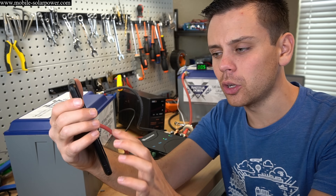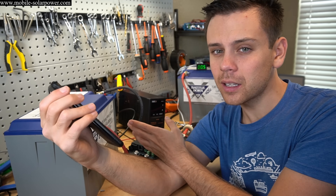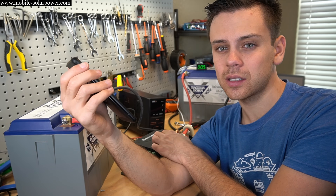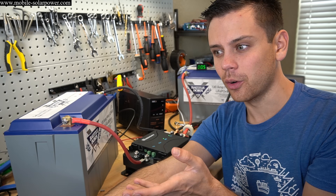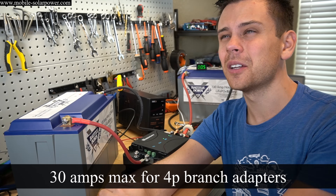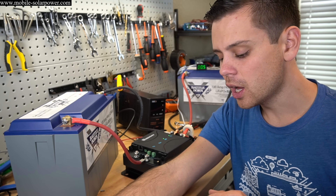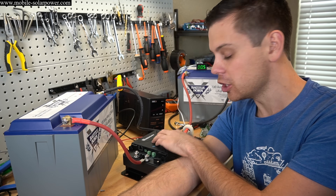Here's some bad news: the max solar input voltage is only 25 volts. With a typical MPPT I'd expect 80 to 200 volts, but this is only 25 volts. That means anyone using this in a vehicle-mounted system will have to put all panels in parallel. The current limit for most MC4 parallel branch adapters on a roof is around 20 to 30 amps, so check how many amps are coming down your wire run. You'll also likely need 10 or even 8 gauge wire to bring all those amps to this unit.